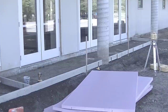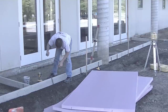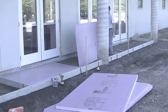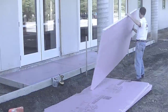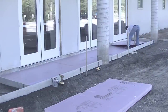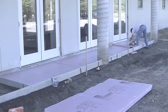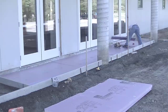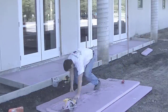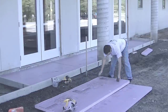I'm getting the boards finished and set to grade. We like using screws when we pin these boards to the metal pins — that way when we strip them it's a lot easier than with a double-headed nail. Now I'm installing two-inch styrofoam. I live here in Maine so we have a lot of freeze and thaw cycles, and that styrofoam helps protect the walkway from heaving in the winter. It insulates the ground so the frost can't get through the concrete down into the sub base below it and heave it.